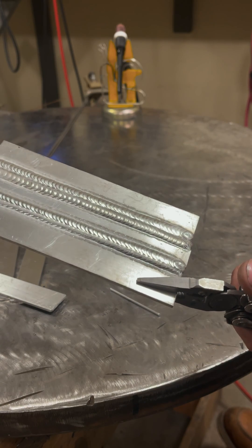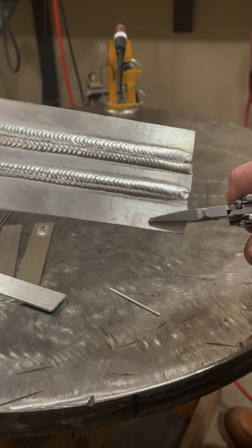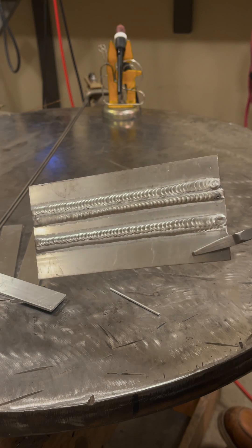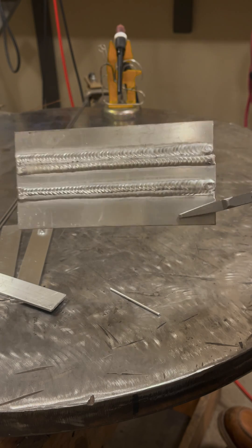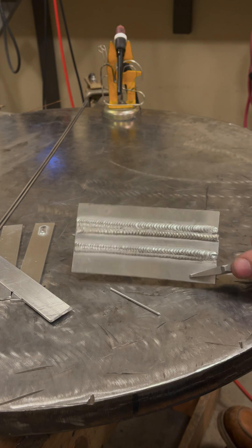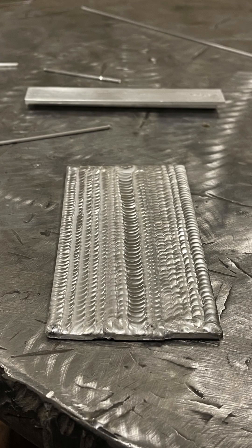The plate's pretty hot right now. Overall, same stuff we're aiming for — very straight welds, consistent in width and height, minimal craters, decent starts. You can see it got a little hotter and the bead got a little flatter, but overall looking pretty good. There's not really too much penetration through the back. I'm going to continue welding this out and I'll put a pic at the end of the video to show you that. Keep doing this yourself, do a couple of practice plates and you'll get the hang of it. If you have any questions, get a hold of me — otherwise, go build something. Thanks.